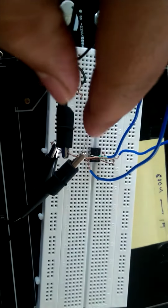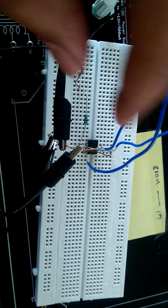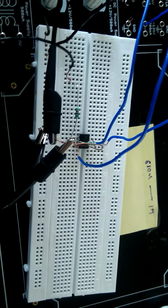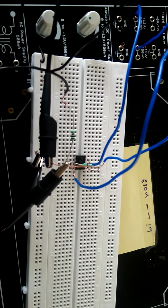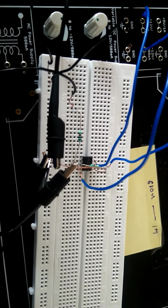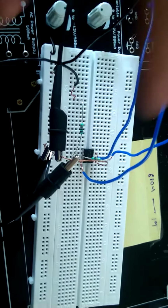See, this resistor is R1, that is our input resistor, and this is my RF resistor, that is your RF. So in an inverting amplifier, we know the output is the amplified version of RF upon R1. Here we are using R1 as 1 kilo ohm and RF as 10 kilo ohm.